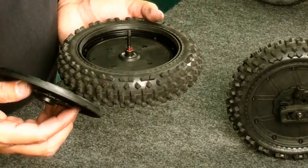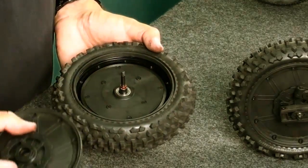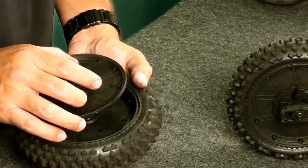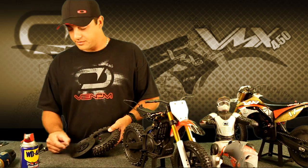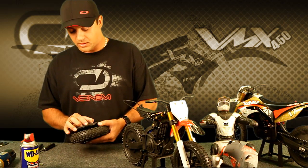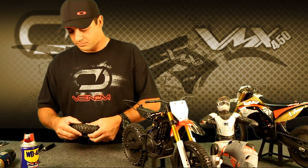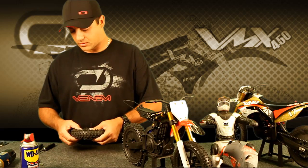This is probably the trickiest part of assembling the wheel — getting this lined up on the first shot. This is the wheel cover and the wheel. What you want to do is just sight one of the holes and one of the threaded screw holes. With the ball bearing not installed yet, sight one of the holes, match it, and basically eyeball it into place. Then work the bead lock in to make sure that it's engaged correctly.